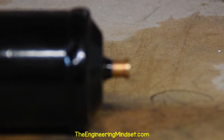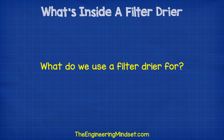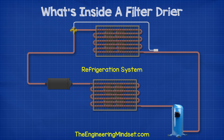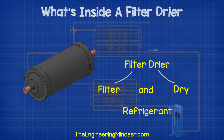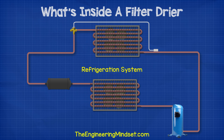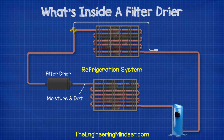At each end, we have some solder connections which can either be pure copper or copper-plated depending on the model. So what do we use a filter dryer for? These are found in refrigeration systems, and as you might guess from their name, their job is to filter and dry the refrigerant. They protect the refrigeration system and its components by capturing and absorbing water particles as well as harmful solid substances. This will prevent them from cycling around the system and getting into the compressors, the valves, the sensors, etc., to keep the system running in optimal conditions.